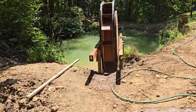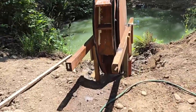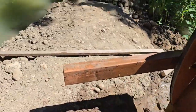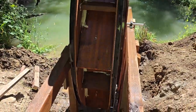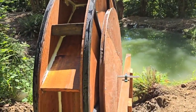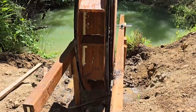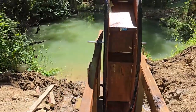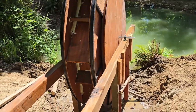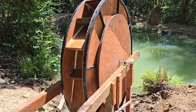This back overhanging part is where the motor is going to sit. I'll have two pieces of channel metal going one way so I can adjust side to side, and then two more going the other way that the generator will sit on, so I can align everything up perfectly with the wheel and the lower smaller pulley rail. That's five and a half feet for the reel itself — the wheel is seven and a half feet. Those are pillow bearings. I'm excited to see how it does with the generator on it.